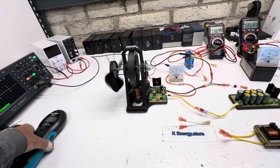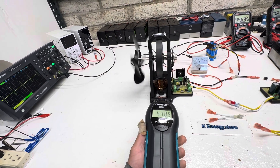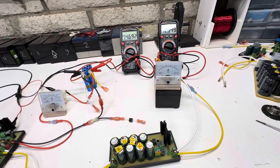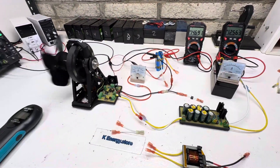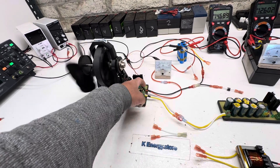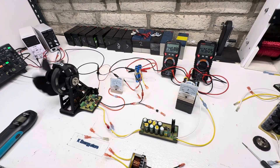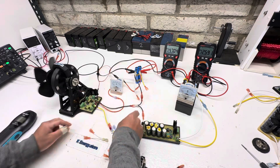The first way we want to run it is just standard, just like a Bedini motor. We can see the RPM — about 400, a little over 400 RPM — and we can see the cap dump pulsing at a little over an amp, about an amp and a half each pulse. This is the standard way: the diodes come right off the returning leg of the coil, the positive gets power from the diodes, and the negative connects straight over to the positive of the first battery — in this case, the super cap.